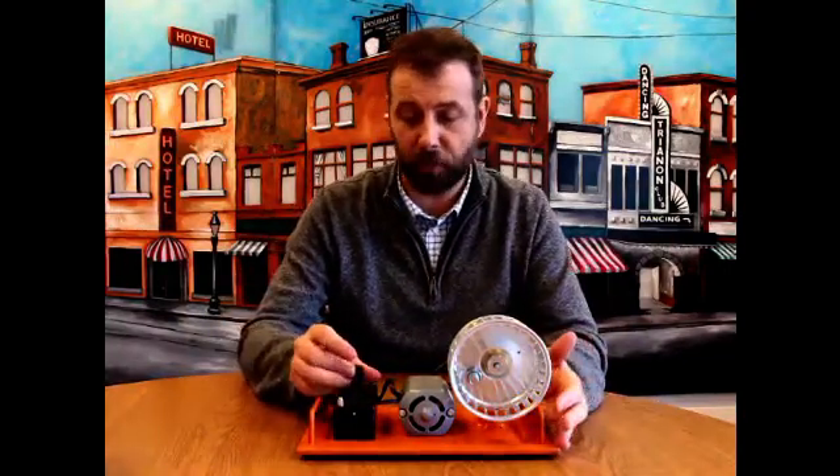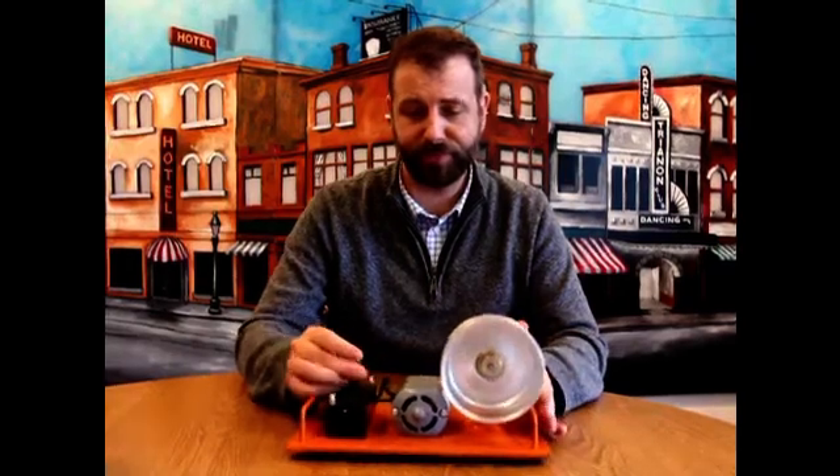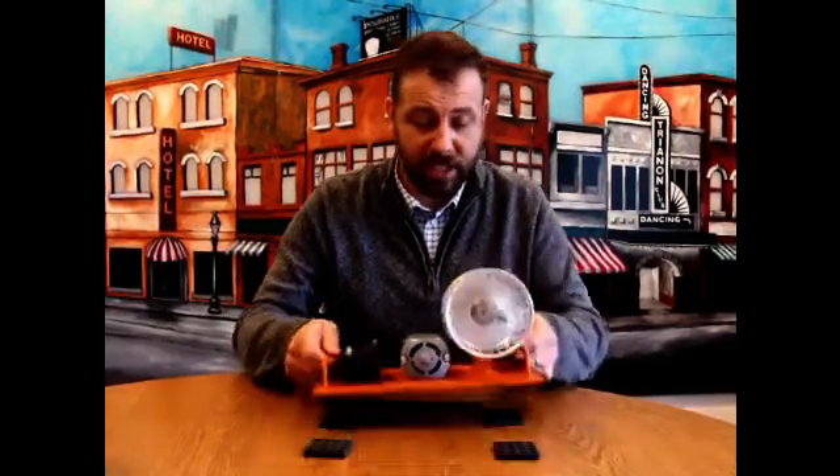So I put it on there. Now we've got it isolated with rubber between the piece of equipment and my table. Let's see how it helps us out. As you can see, it didn't really help too much — in fact it kind of bounced around more than it did before. That's because we're really not getting any deflection, and that deflection is what gives us vibration isolation efficiency. The greater the deflection, the better our efficiency. You'll see those numbers sometimes — isolation efficiency — that is a percentage.